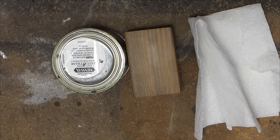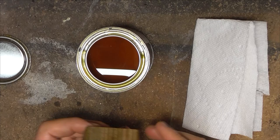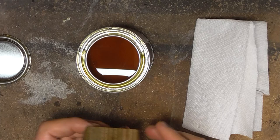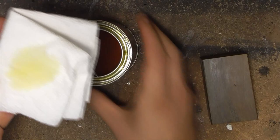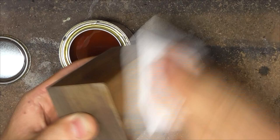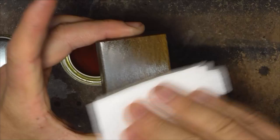Varnish is a gigantic category of finishes that are various kinds of polymers that can be rubbed into wood to give them a strong shell that resists scratches and blemishes — it's the same class of finish put onto hardwood floors. In this case, wipe-on polyurethane. This comes in a satin and gloss variety, depending on what you desire. The same rules apply for oil in terms of application, but you'll likely need at least two coats to get the right kind of feeling. Once you have done one coat of varnish, let it dry overnight and lightly sand it down with some 400 grit paper, dust it, and then put another coat on top. You can repeat this as many times as you want, getting a thicker, more satin, glossy, and resistant finish each time. Varnish gives excellent protection through its layers, but it does have a caveat in that it will darken orange with age. This usually isn't a problem, as wood is brown as it is — which is the dark version of orange — so the color rarely hurts the final appearance, and it takes decades to be noticed.